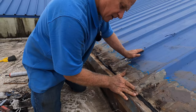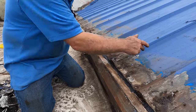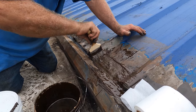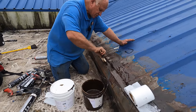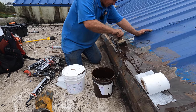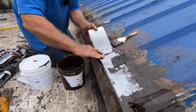This is a crucial step — everything has to be clean and well prepared. Then I paint Turbo Polyseal using a three-inch brush and cover this area. I put the fleece down, making sure it goes snug against the roof. You can see the roof cement underneath is filling up that void, that gap.